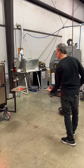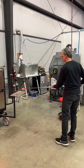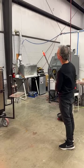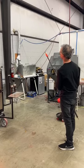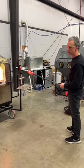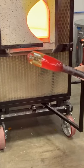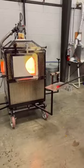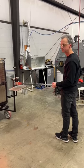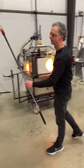We try to keep the glass around 2000 degrees, but we adjust the furnace settings every day — we turn it down at night, which makes us feel a little bit safer. The disadvantage is it's hard to tell the temperature each day — sometimes we've got it too cold, sometimes too hot, but today it's a pretty good hot temperature. You can see he's rounding out the tip. He's got a good size air bubble in there. We want the glass nice and cool so the bubble doesn't get crushed or fall off.